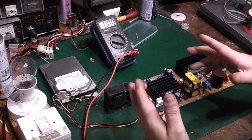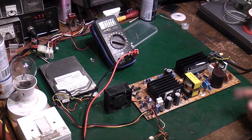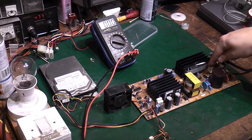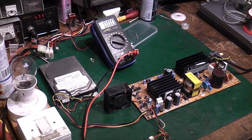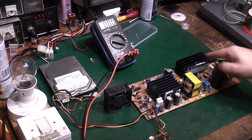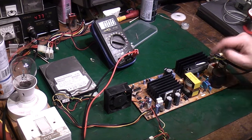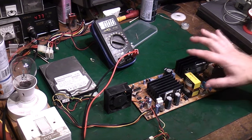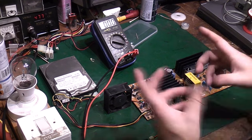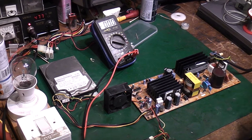I mean, there's some of the numbers and what have you. I can basically make out what it does and how it should connect, and the fact that that chip there is like a companion chip. It's like a voltage comparator that it uses to send feedback to that. Fortunately, this seems to be very much the stock circuit which I found in the data sheet for that there. Looking at what components we've got down there, I think they've basically used the stock example from the data sheet for most of this.